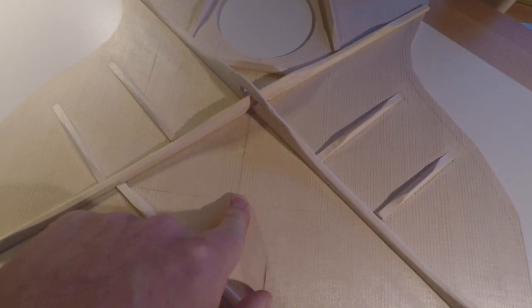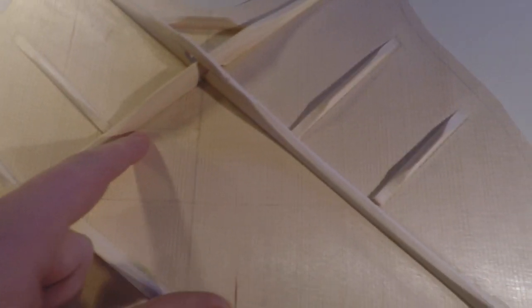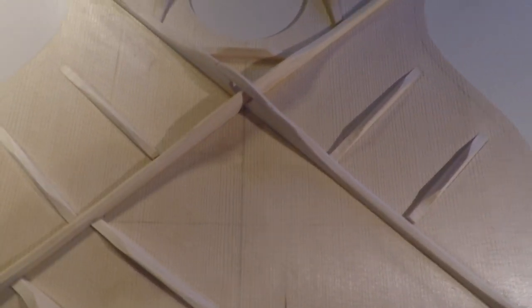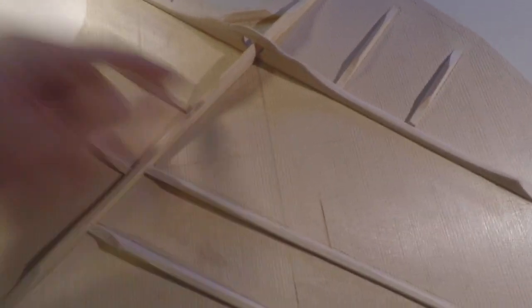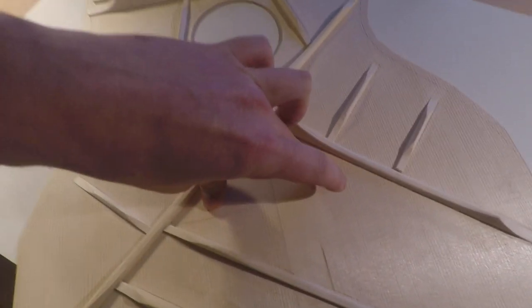Most of the time we use a spare part of the backside of the side of a guitar. Same as with this plate, the grains of the wood should go in this direction. So together with the bridge we receive a kind of triplex plate. So grains go this way on the bridge plate, this way on the top, and again this way on the bridge itself. For gluing this, we also make a little piece of wood with the curve of 2 millimeter, just for clamping the bridge plate.